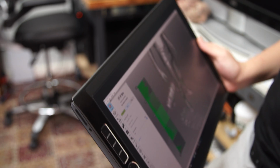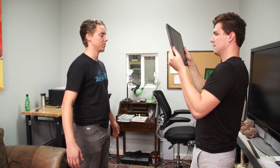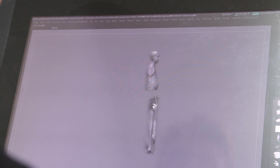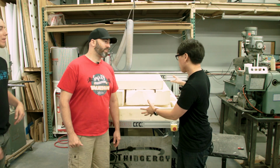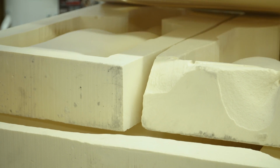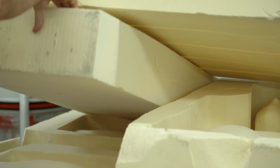That's right. So with off-the-shelf parts, you can get a scanner. People use photogrammetry scanners; that's something you can do at home. There are off-the-shelf parts where you can just get a virtual object, import it, and then you have a guy who turns that into something that can be milled using this right here. This is the CNC router, and you're milling pretty thick foam. You can get huge chunks of foam. I used it back when I made a dragon a couple of years ago. But this we got in just 6-inch parts because that's what fits under that gantry. Then we can mill it out into a bunch of pieces and make our Gunther model kit. And that's where we are right now.